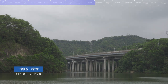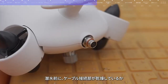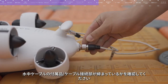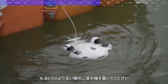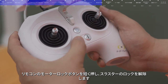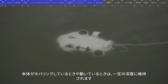Pre-dive preparation. Please operate in an open area with barrier-free and high visibility. Before diving, check whether the tether interfaces are dry and whether the Q interface and tether port of the submersible are correctly and securely sealed. Hold the rear wing for deployment. Put the submersible in water with a depth of more than 0.5 meters. After placing the submersible in the water, press the lock/unlock button to unlock the thrusters. Press the depth hold button to turn on depth holding, and the fuselage will remain at a fixed depth when moving.